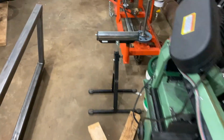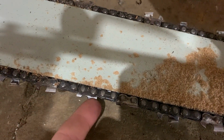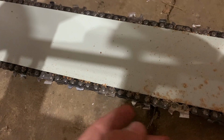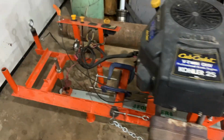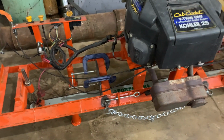So what I did is I made a skip tooth chain, which if you see over here, this is a full-size cutter. These 2 I cut off with a cutoff wheel, and then 2 more full-size ones. Same thing down here, 2 full-size, 2 chopped, 2 full-size, 2 chopped. So every other left and right cutter is gone now. I ground them off with a cutoff wheel. And that actually produced the best results for reducing vibration, because in those big slabs, we were milling 12-foot long slabs that were 5 foot wide, almost 5 foot, like 57 inches in the widest spots.